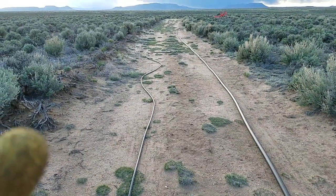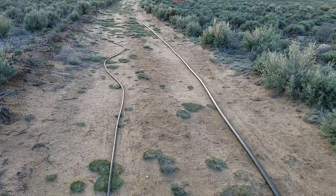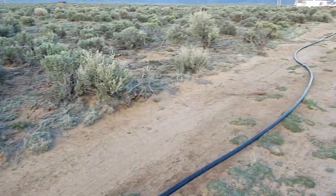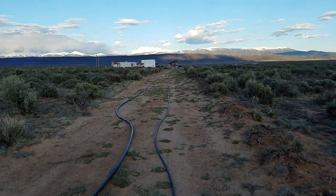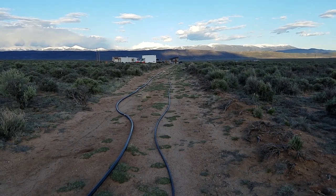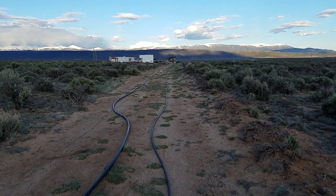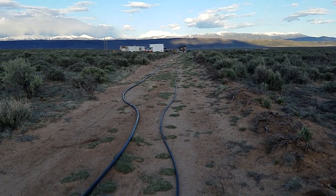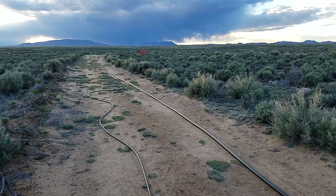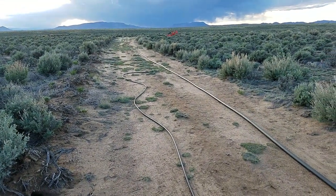Right here I'm showing the ends of a 400-foot hose and a 500-foot hose. To give you an idea, this is a little over a quarter mile of track. We were just down on the other end putting the airlift on the other end of the hose. That's what it looks like to drop over 380 feet for the airlift pump, have an extra 120 feet of drain hose to redirect it, and then 100 feet less for the air hose connection to keep it close.